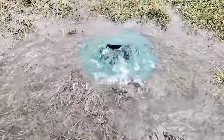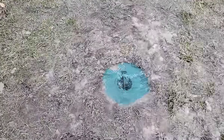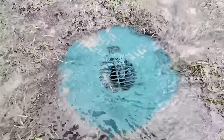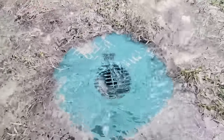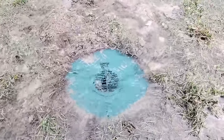When you take the water in an inline basin underground, you have a solid pipe and you pipe it through some of those high points that dam it into the yard. You dig a little deeper in those high points and just make sure that you have some slope — about 1% slope. That's all you need. Don't have to work that hard at it. 1% comes pretty easy. And you just keep hitting all these points of collection with one of these inline catch basins.